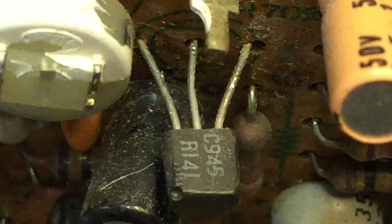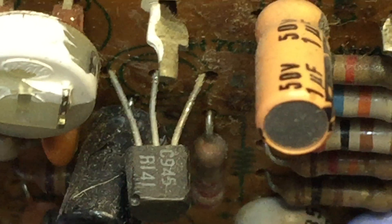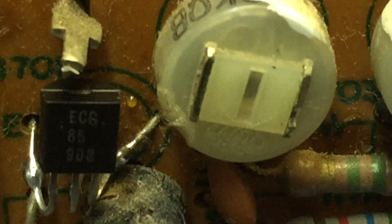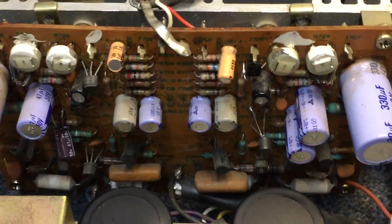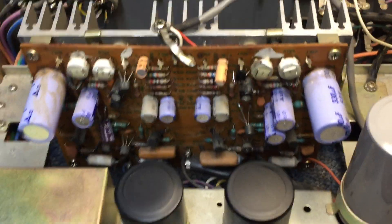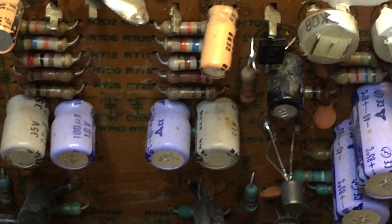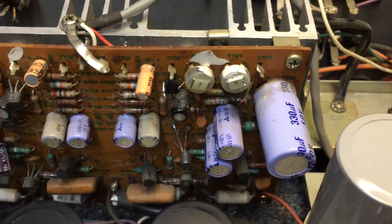The other thing I found here that is really disturbing is that over here the 2SC945 — arguably the most common silicon transistor on the planet — was replaced with an ECG85. This was done at a shop. I've got nothing bad to say about a DIY person without the knowledge or skill, but if you have a shop and you don't have a 2SC945 either new or one you can pull from a circuit board, you need to give up and stop jumping these in.